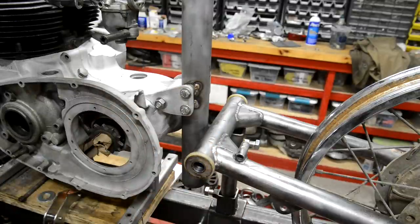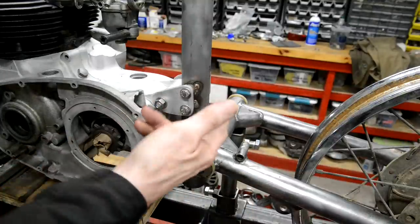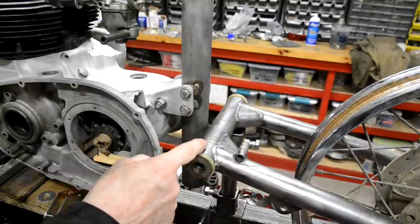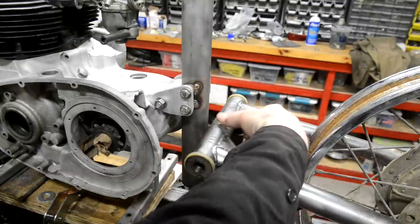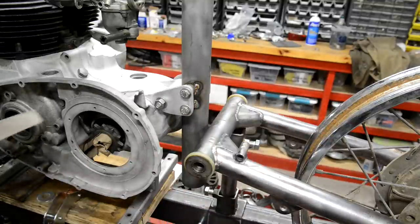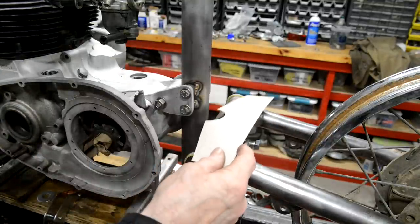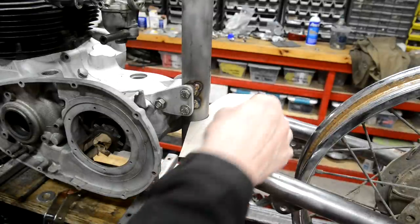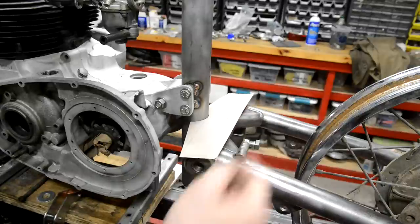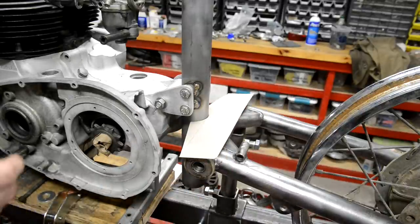Okay. So then we need a top and a bottom. And as I say, if I make this box 2 inches, then the top piece, being 2 inches wide, will go right up against that. 1 3/4 inch tube, so I've made a 7/8 inch semicircle. So that's going to go on there like that. Right? And we'll have our end pieces, the bottom piece.